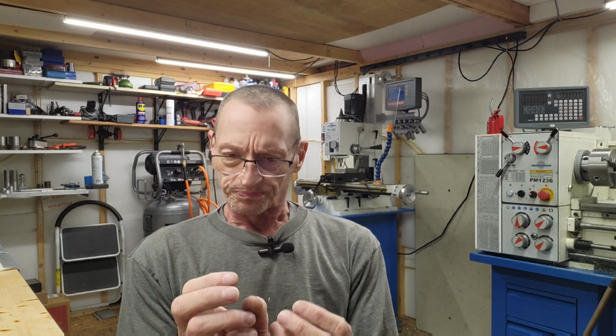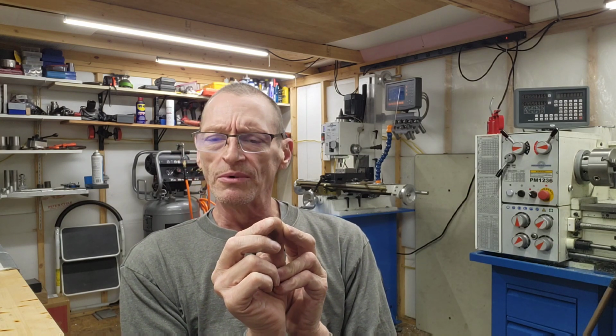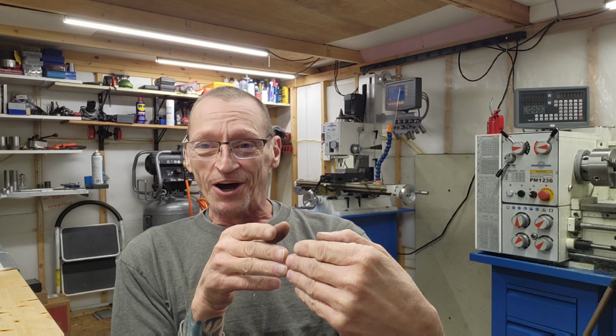Austin arrived here with his truck, and he wanted to bring it over so I could fit the gears correctly. We're going to make our gear a little bit better. We're going to make it stronger. So I need this in front of me so I can see the thickness, how much thicker I can make the teeth. I'm going to widen them up a little bit, put a little bit more meat on them, because he tore some gears off. But we also know that the engine was out of alignment, which plays a big role in loading gear teeth correctly. You got to load them equally, and have a consistent engagement, a certain percentage of engagement. Gears, thread engagement, gear engagement. Engagement plays a role in many mechanical applications. And this specific gear got tore up because it was out of line and engagement was off. So we're going to make them a better gear, and we're going to get this handguard cut this week.